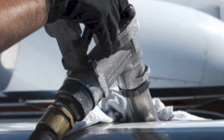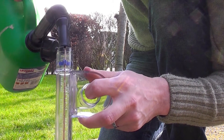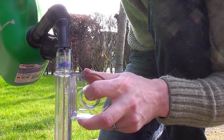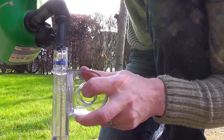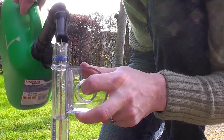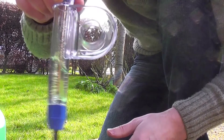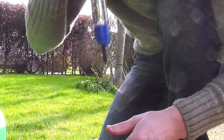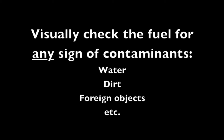Here I'm taking a sample of fuel — it's actually from a jerry can and it's motor fuel, normal petrol, not aviation fuel. The difference being it isn't as highly controlled, and it's also straw in colour rather than the blue you'd see in Aviation 100 Low Lead. I'm having a quick smell — it smells of fuel, it looks like fuel, and I'm just checking to see if there's anything in there. It looks clear, but remember the specific gravity of water is 1, and our gas is less at 0.72.